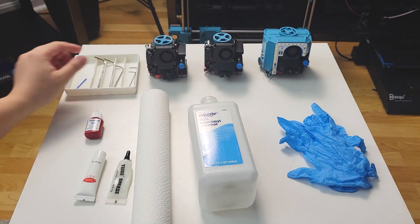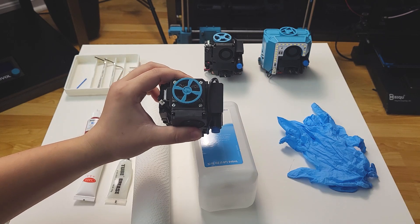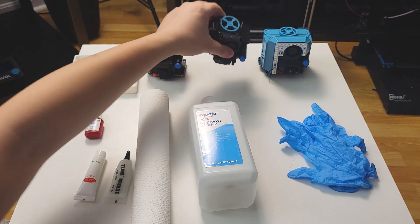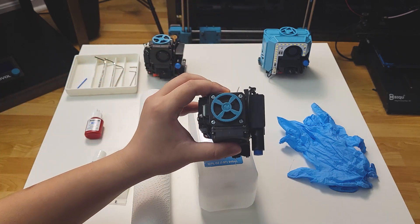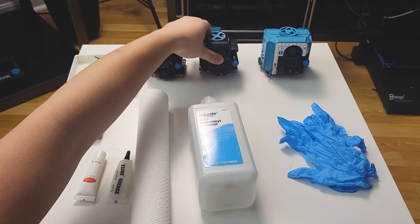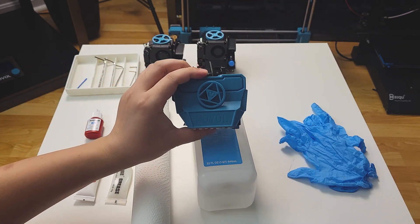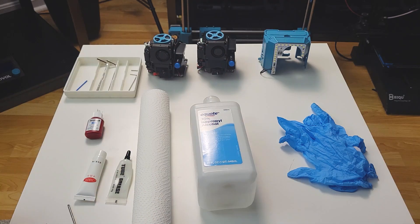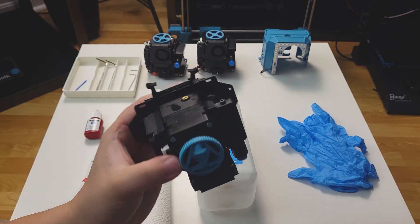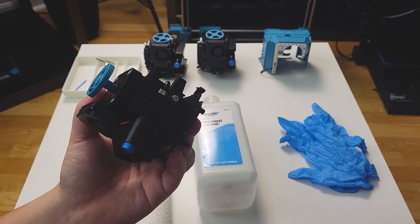This issue affects all SV06, SV06 Plus, and SV07, but we are going to put SV06 Plus and SV07 in a different video. Also, some people suggest not putting thread lock on the pinch screw, or you don't want to put it on. I personally think it's better to put it on, since the spur gear where the pinch screw is located will encounter a lot of fast speed rotation and vibration, and some people have proved that it will come loose over time after they tighten it — but it is still up to you.